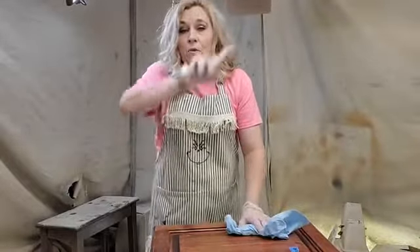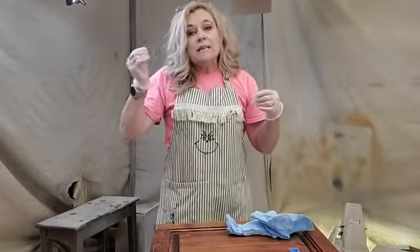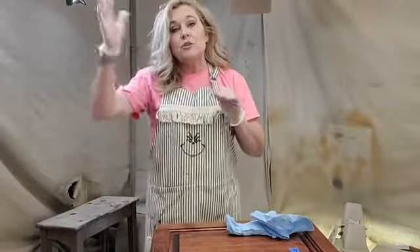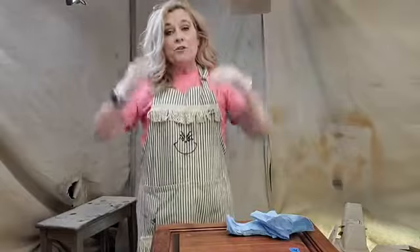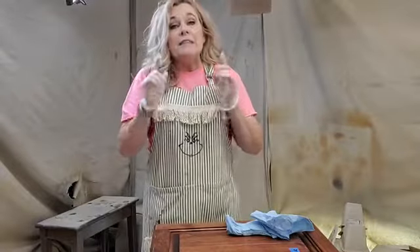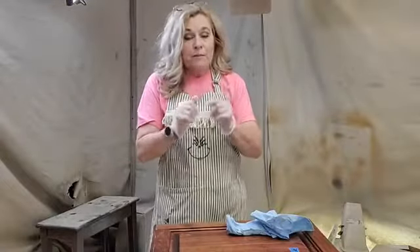Where they meet the ceiling, make sure you use the least sticky tape you can get away with. I usually use Frog tape — yellow tape — because if their ceiling has ever had a leak, ceiling paint can pull off very easily. A lot of the kitchens I work in have cabinets that go all the way to the ceiling, so you want to be careful. Tape, drape, and cover everything you can't remove from the countertops. Cover countertops, cover sinks. It seems like an anomaly but taping and draping actually makes you work faster because you're not worried about edges. Tape your drop cloth in place so it can't move. I promise, you'll thank me later.